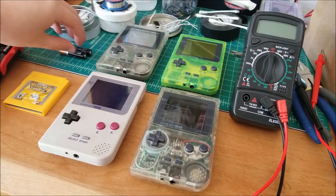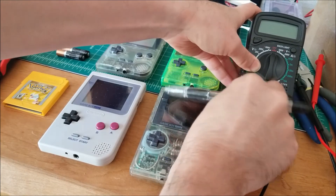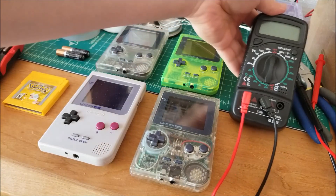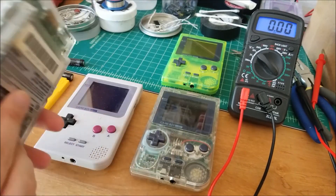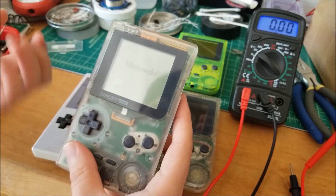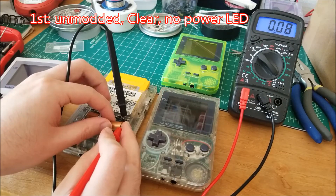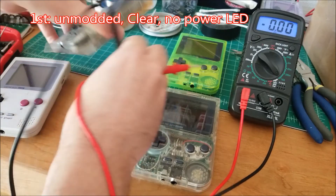Test conditions: I have a copy of Pokemon Yellow, the same two AAA batteries, and a multimeter on the 10-amp range so I can get larger measurements — I have a feeling these two modded units might draw more than 200 milliamps. So this will read in amps. The first unit is the clear, unmodded one with no LED. I'll set each to a reasonable contrast and volume on max to see almost the worst case. It's drawing about 80 milliamps, peaked at about 100 milliamps, so nominally about 90 — I'll call that 100 milliamps.